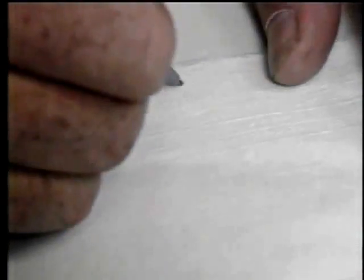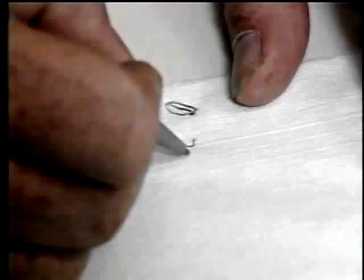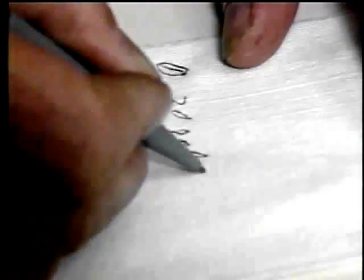Okay, we need to start at square one and answer some basic questions, I guess. Now, the label requires 20 gallons. It's really important. That's probably the minimum requirement. So you need to apply at least 20 gallons. So we'll have to make sure how your sprayer's set up. I guess the second question is what kind of speed you can use for the conditions where you're going to apply this material. Well, I'm set up to go at 5 miles an hour. Well, third then would be what pressure do you want to operate this in?